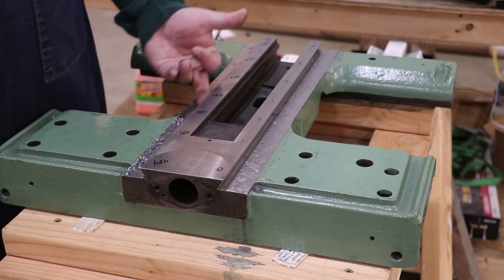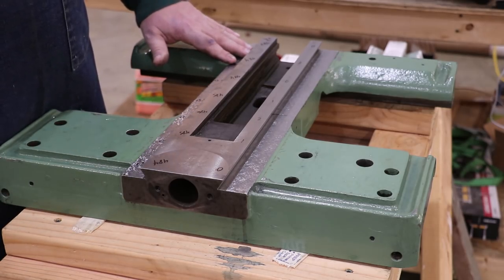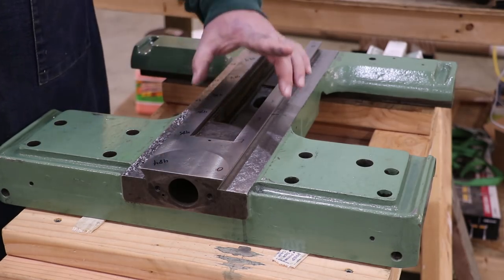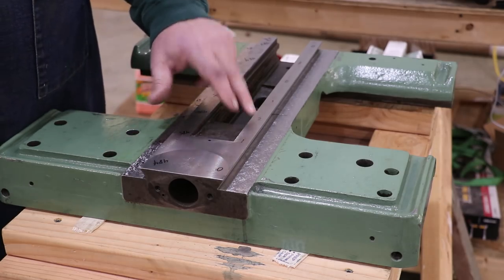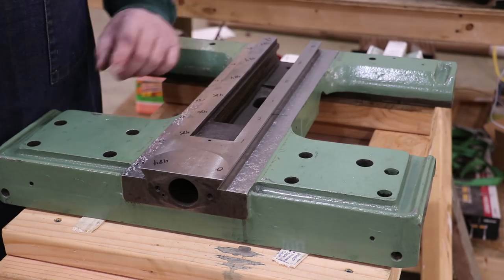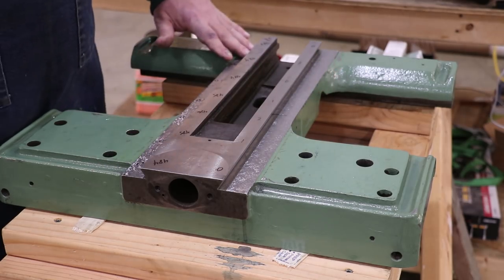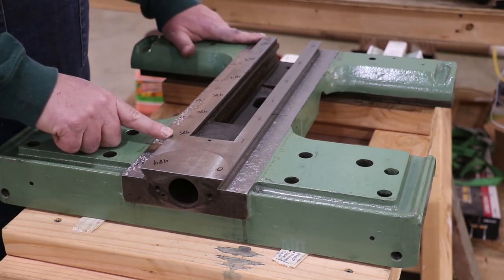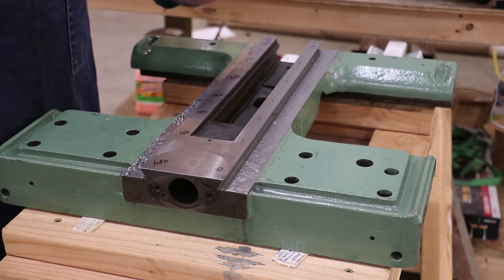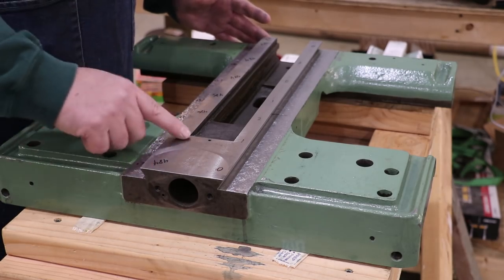We also worked on this dovetail - the inside top part - and according to the straight edge it was bluing up from one end to the other pretty well when we stopped. But when we measured the distance across, it's about two thousandths wider here than on the end - 0.0021, 0.0010, that's thousandths of an inch. We haven't worked on this other side at all, so that two thousandths may just be a high spot over here. I want to check this again because the straight edge we were using before was short and I had to spot it in two different places. I've got my longer straight edge back now - I want to blue this surface up with it just to make sure we don't have a little hump on this side.